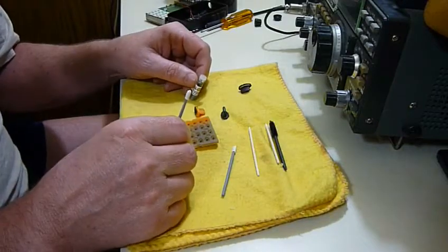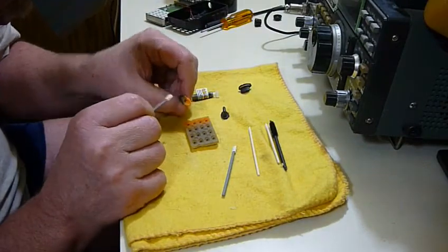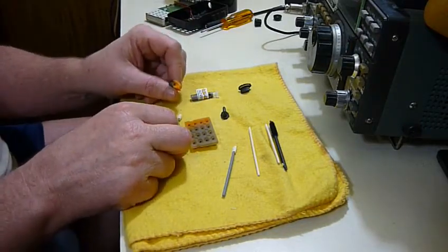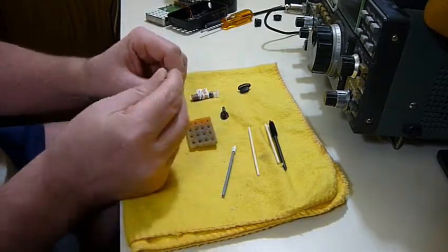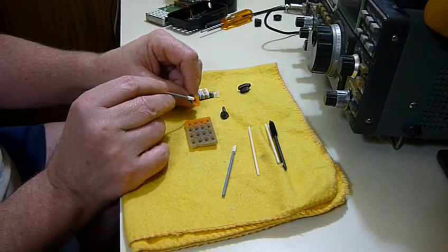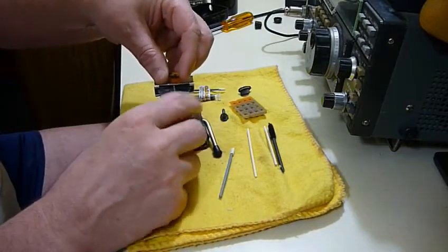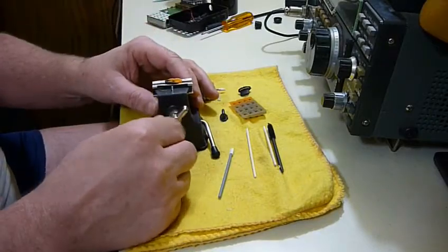And I'm thinking take one of these little applicators and dab the tiniest amount. I don't know if you can see or not, but these carbon pads in this particular membrane switch setup are very small. They're about 2 millimeters across, and you don't want to get anywhere else. So even with this little bitty applicator, you can see it's going to be very close work. And I probably should have something to hold that. I'm going to put that in this little hobby vise. Otherwise it's going to be falling over. I'm trying to deal with it.